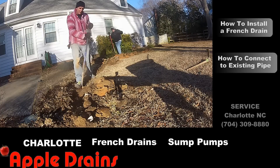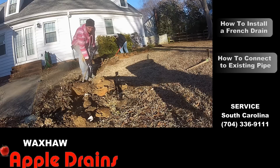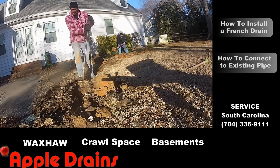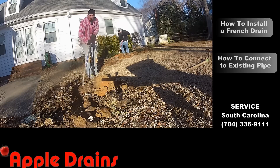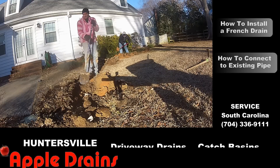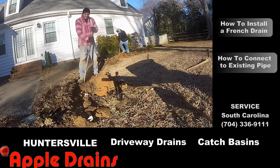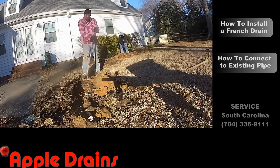Digging by hand is a very arduous and difficult task — you can hurt your back quite easily. If you notice, we're digging backwards. In other words, we work backwards through our trench. You don't have to jump on the shovel; just sink it down and pull out the dirt. Scoot that shovel back about 4 to 6 inches from the last place, use your body weight, wiggle that shovel straight down, and pull out great big chunks of dirt.